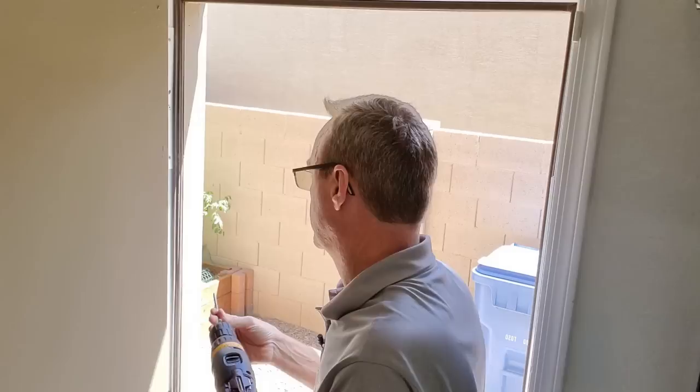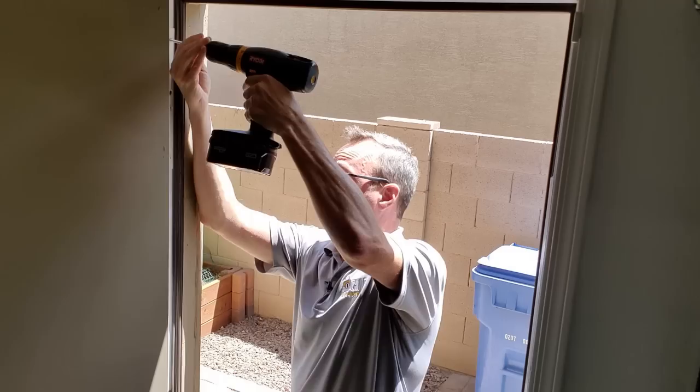One thing I should mention: I didn't pre-drill any pilot holes and I'm having a little trouble getting this screw in without stripping the head. You can always pre-drill those holes so the new screw will go right in — I recommend doing it. I tried to skip that step and it didn't work out. It goes in much nicer after you pre-drill. Now that hinge protector is all done — there you go, all on. Now all I have left is the bottom one.